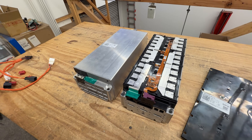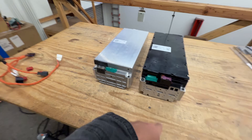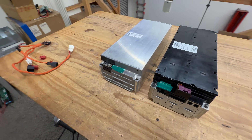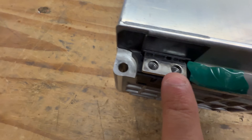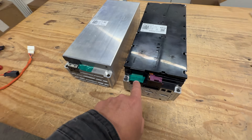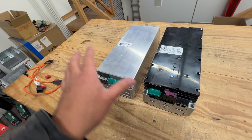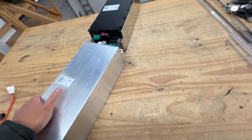These newer ones are going to be a little more expensive because they have more capacity. The older ones are more plentiful, so we're pricing those lower to move them faster. You can find both on our website at jack35.com. They both have the same M6 threaded bolts. When designing your custom application, keep in mind there's an A and B version — the A has the connector on the negative side and the B has it on the positive side.